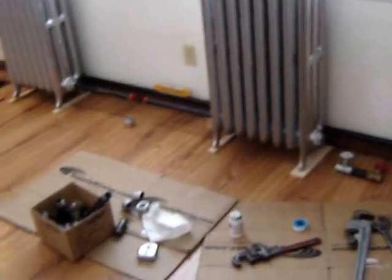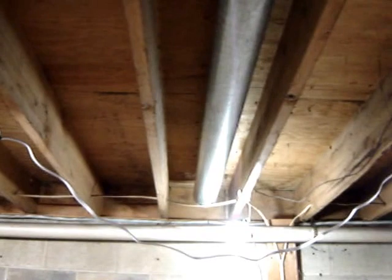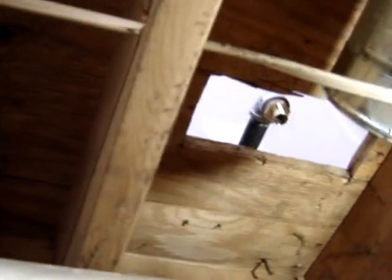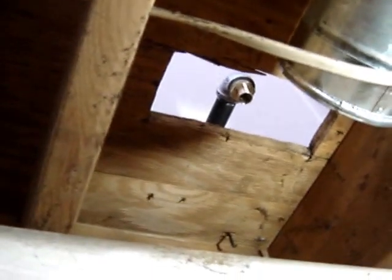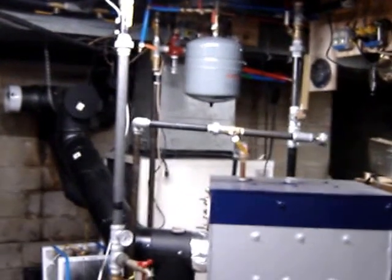So this morning I'll get this threaded piping done up here, and now we'll go down to the basement to have a look at where it's going to end up. This is the floor joist bay we're going to run it into. As you can see, there's the PEX return part up there, and we're going to run the supply and return PEX lines down this bay — it's all going to end up over here at the boiler.